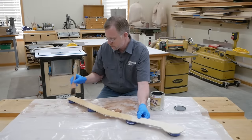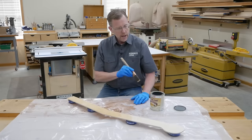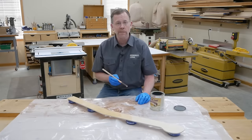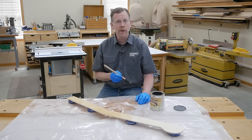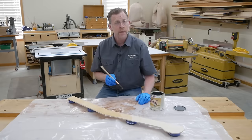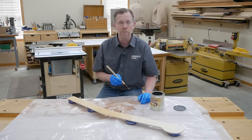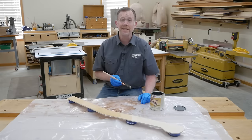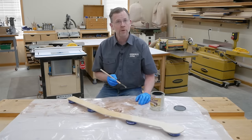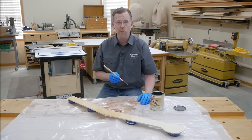After the sanding is done, your template is ready to go. Here's one last tip: if you've got some finish you want to use up, put a coat of it on your template. It can be any film-forming finish you have on hand — shellac, varnish, lacquer, doesn't really matter. The finish will help prevent double-sided tape from lifting fibers out of the template material, and it also makes tape residue easier to remove. This is one good way to help your templates last longer, and after all the effort you put into making them, it's well worth it.